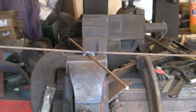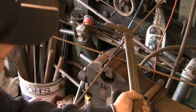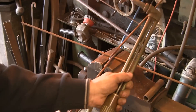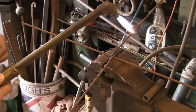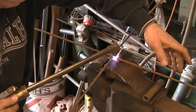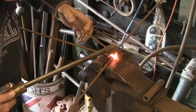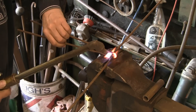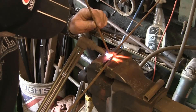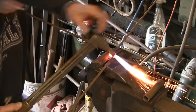I'm going to put the camera up a bit so you can see better. Now you can basically see what we've got is a cross. So I'm just going to get the gas torch lit again and heat each bar in turn. It doesn't matter which one you start with — well, obviously it's got to be the one that's going through the loop — and you want to keep the heat nice and short so you get a nice tight bend. Just pull it up and over, so it goes level, and do the other side. Try and keep it nice and tight, and we get a nice neat braid, I hope.